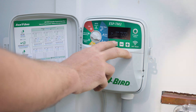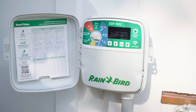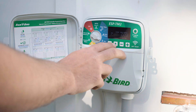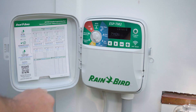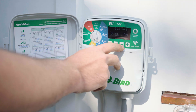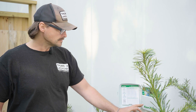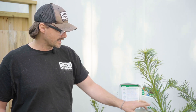If you hit the over arrow it'll go to station two, or zone two. You can go up to six zones or six stations on this specific ESP TM2. The next thing is the watering days. If tomorrow is set to on and you want it off, hit the minus box and it goes to a crossed-out water droplet, which signifies it's off. To turn it back on, go back to that day and hit the plus.